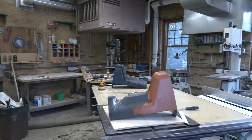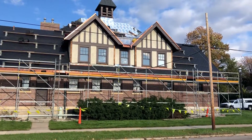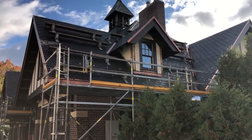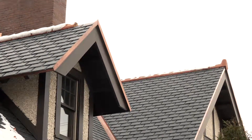Historically it's just part of the entire Sawyer Estate, and this fall we had a new roof put on it. But when we were doing the roof we were missing key ridge caps, which is really important on a slate roof. Even though we put artificial slate on there, it still needs the ridge caps.